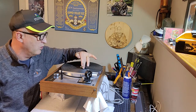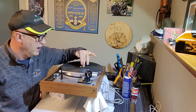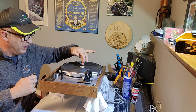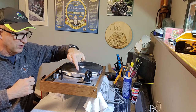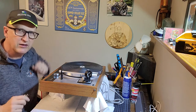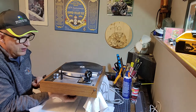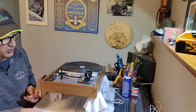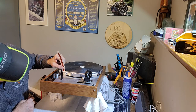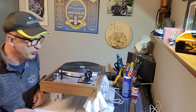And you're going to adjust it as a system, so up and down until you get to the proper balance. And that's exactly what you're looking for right there. See how it just goes up and down, not jiggling or anything? Use your 8mm bolt to adjust them from the inside. I normally go to, so we're really at about, I'd say 5.5mm for this turntable. It depends on how big your springs are.